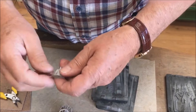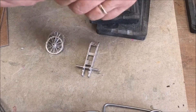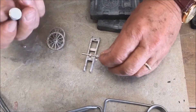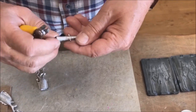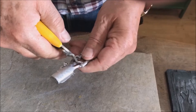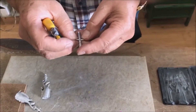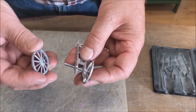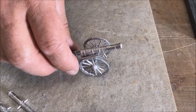Next we cut away the excess metal from the gun carriage. All the excess metal can be remelted. The axle fits underneath this — use gel super glue to fix the axle to the carriage properly. Now cut the barrels off their in-gates. You can use a metal file to clean up any rough edges left over from cutting. When you have all the cannon parts cast and cleaned you can begin to assemble them. They should fit together fairly easily. You can glue them together and select your preferred barrel for that cannon. At that stage you can prepare to prime them and paint them.